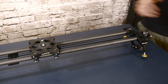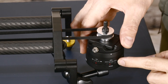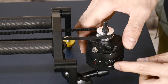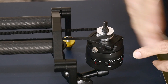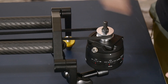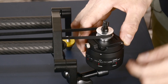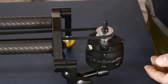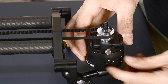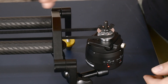This is on the fast setting, which is what you'd want for shooting real-time videos. There are a couple of things to look at. First is the type of rotation: there's 360 degrees with intermittent stopping, which could be useful for long exposures; then there's side-to-side panning with stops — we won't use that for a slider. We'll want to use the continuous revolving setting all the way to the right — that's what keeps our carriage moving forward and backward. For speed, as mentioned, time-lapse won't work due to insufficient torque; we'll use normal and fast. For direction: in the off position, turning it toward me revolves counterclockwise and brings the carriage toward us; moving it the other way goes clockwise and moves the carriage away.